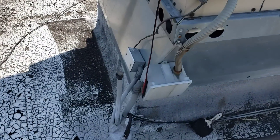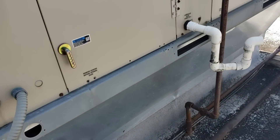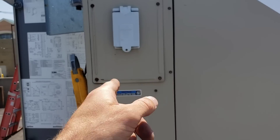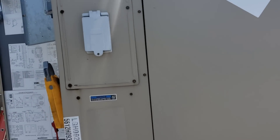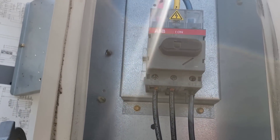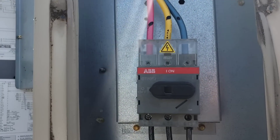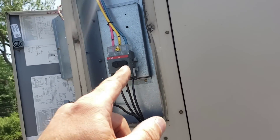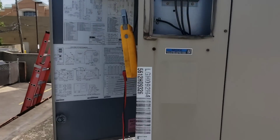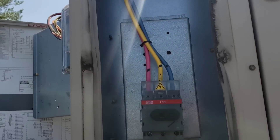We're not looking at a fused disconnect, so let's pull that and we'll check incoming voltage at our disconnect. I can immediately tell that far right leg is having some issues because it's charred and partially melted. I assume that disconnect has gone bad. So I'm going to check for voltage right there, and if I do have proper voltage, I'll go downstairs and shut it off at the breaker and we'll bypass this disconnect for now until a new one can be ordered.